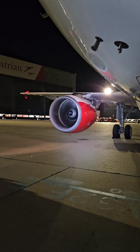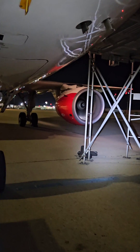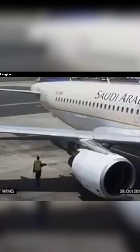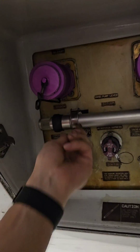But what if the pump is out of order and we need to open the cargo doors? Well, we have of course an engine driven pump, which I really don't recommend to use since the engine needs to run — and if you try that you can end up like this guy. Of course, clever guys at Airbus have been thinking about this and they added a third option: we can use a hand pump which is located in the yellow ground service panel.